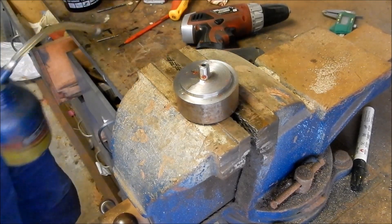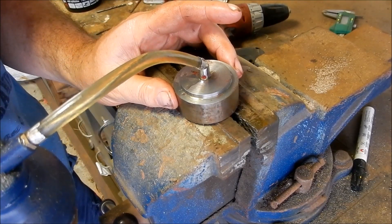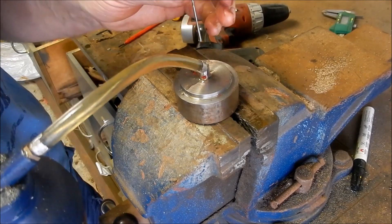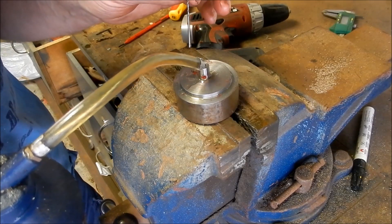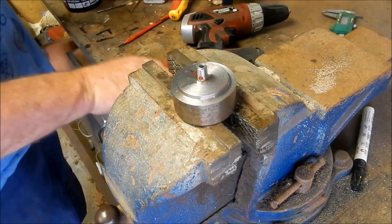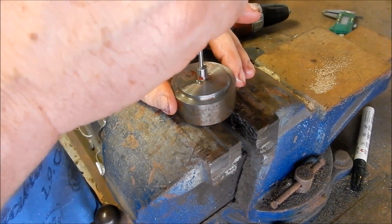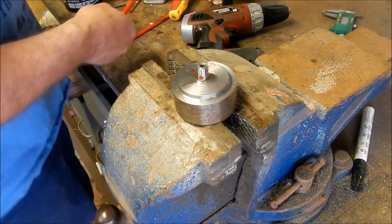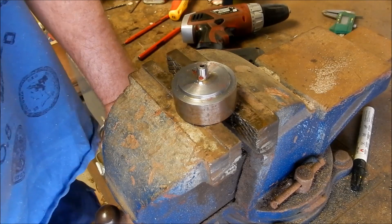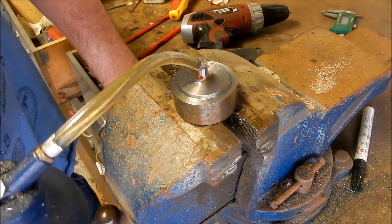The grease was really hard to get into such a small hole, so I'm going to go with oil. What I found with the oil is just let it run down the side so the air can escape while it's running down the hole - if you lock the hole up you'll trap a little air bubble. Now I'm pretty sure what's going to happen is that oil is going to come squirting out on us - and that's exactly what's happening. So I might try and make up a little plug out of a matchstick or something, just to plug that hole up and see if we can't get it moving.